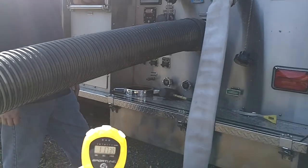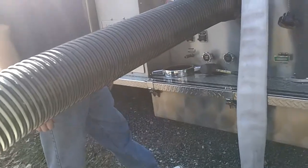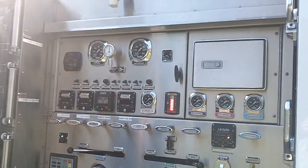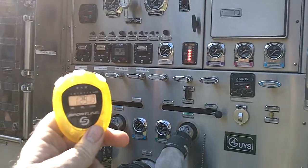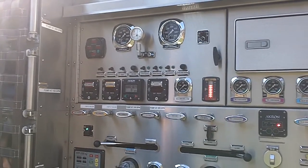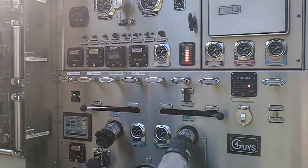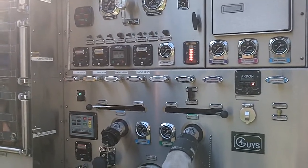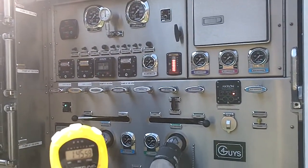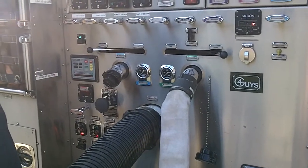We're at 1:16. We'll start to see discharge pressure on this pump once the pump fills itself up. 1:28. Notice our vacuum is at about 14, 15 inches. That equates to about 16 foot of lift from the surface of the water to the eye of the impeller. 1:43, 44. We should start to see some changes occurring as the pump casing fills up.